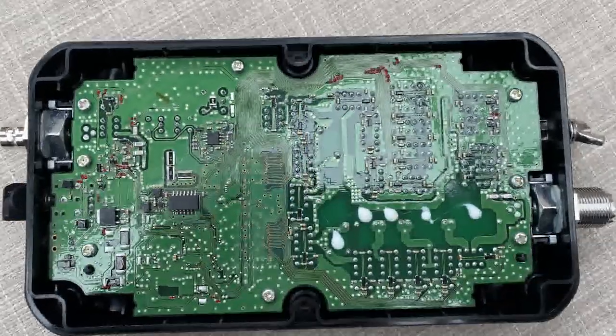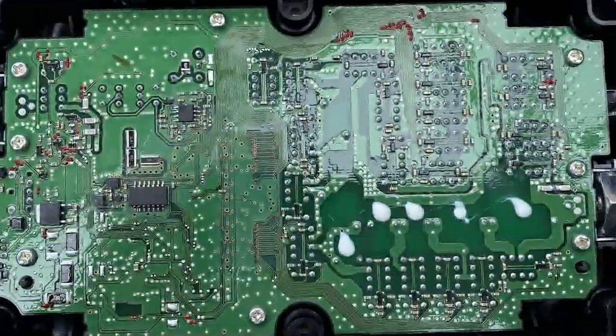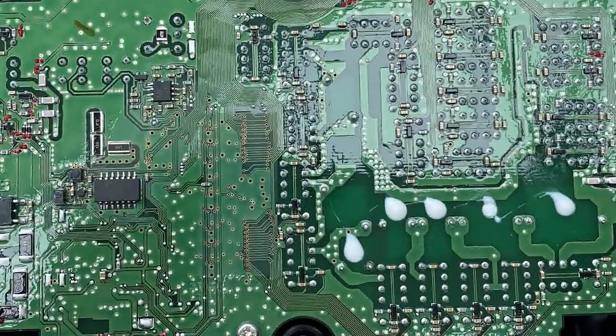Two things I'll mention. The antenna tuner has got a sort of grommet inside, or a gasket inside, so it is waterproof. I would say it is showerproof, really, because I wouldn't want to keep that outside permanently. If you're operating outside and it's raining, I don't think you'll have a problem. Just bring it in and dry it. But because you've got a PL259 there, because you've got a 3.5 millimeter connector there, I'm not so sure that I would say it's weatherproof. I would say it is showerproof, and I would have no hesitation in using it outside. But I wouldn't want to keep it outside on a permanent basis. But it works extremely well.